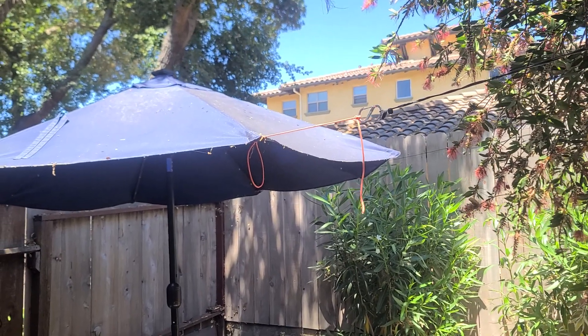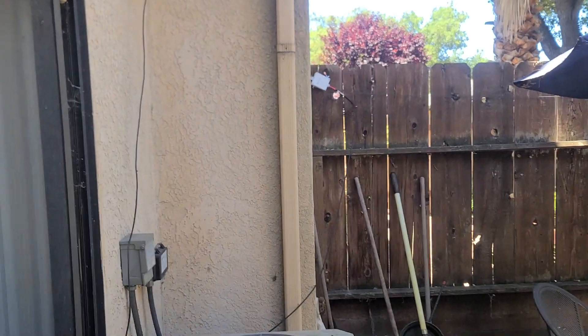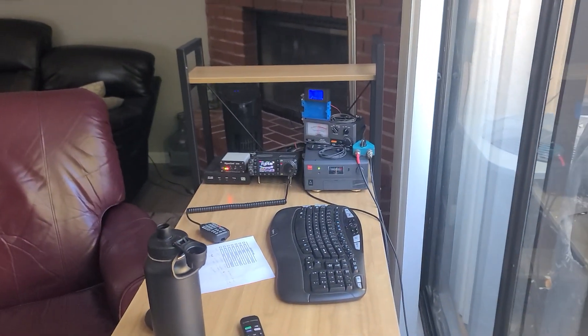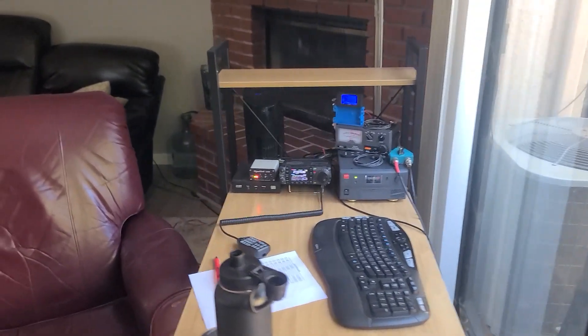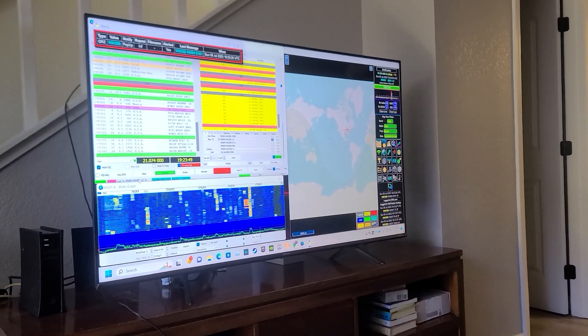I think I've got the antenna at 66 feet in length. The coax comes down here around the AC unit, around the Traeger, through the sliding glass door, and then I've got the radio over here where I've got my ICOM 7000 hooked up running FT8 right now. I've got it hooked up to the big screen TV since we're in the living room.